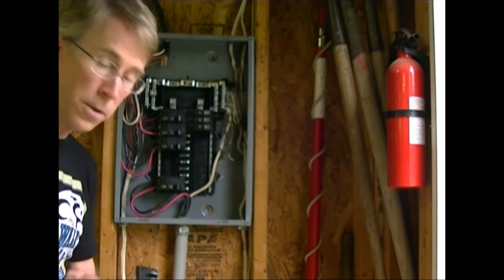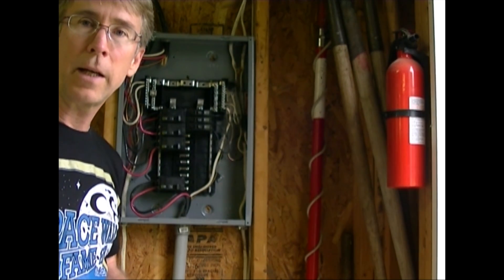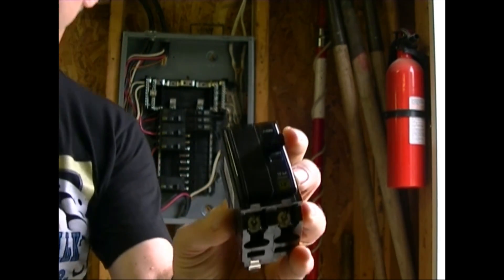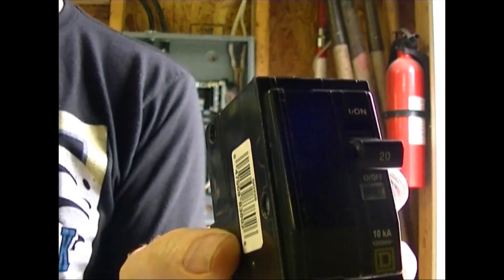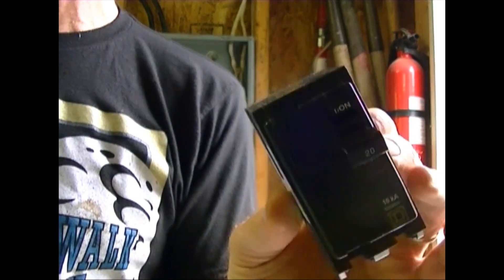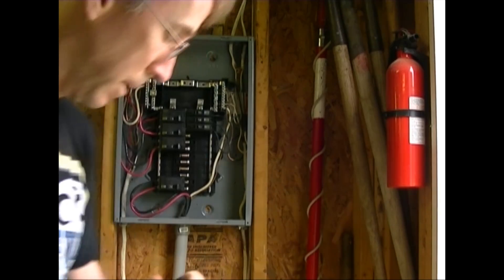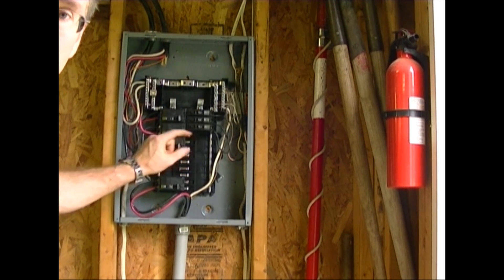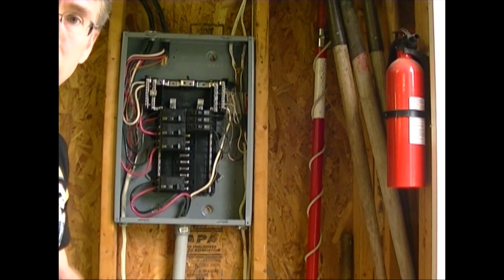The first thing you need to do is get the breaker that's the right size for what you're doing. For my air conditioner cutoff, I was told to get a 20 amp breaker. You can see it has the amperage on the handle — it says 20 amp, 220 volts. 220 means it is a double-wide breaker, so it goes across two of the 110 volt circuits which are 180 degrees out of phase, and that adds up to 220.